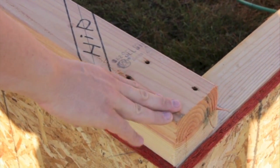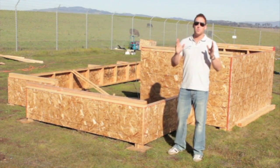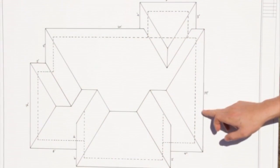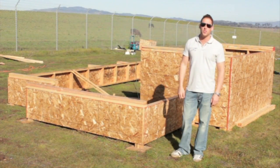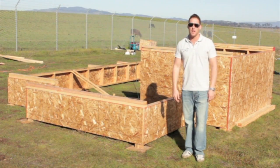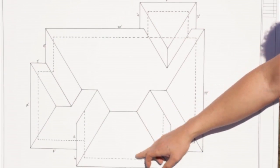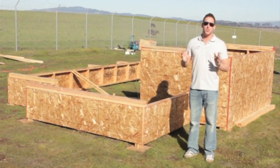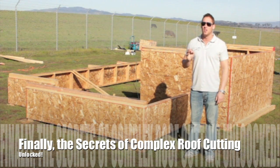And to change the heel heights from one pitch to another by adding extra plates, so we can have the same parallel overhang around the entire building. We're also going to show you how to figure out our rafter spans and rafter lengths when we have multiple plate heights. And most importantly, we are going to show you some basic trigonometry and not rely on the functions of the construction master to figure out this roof.